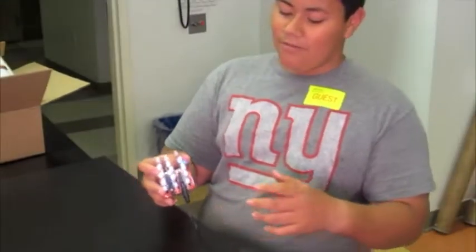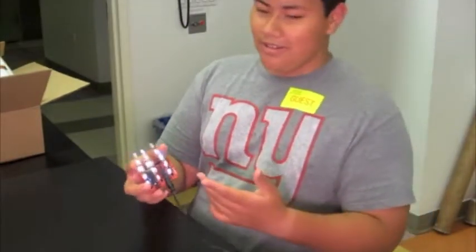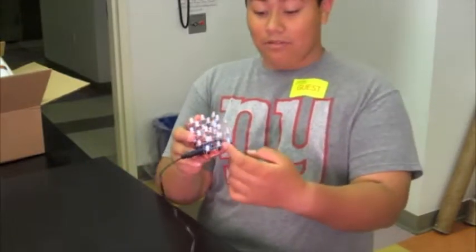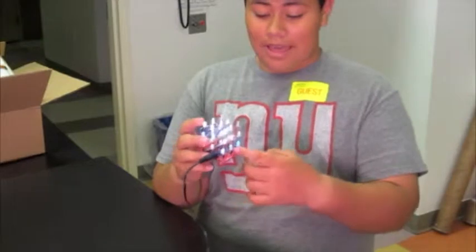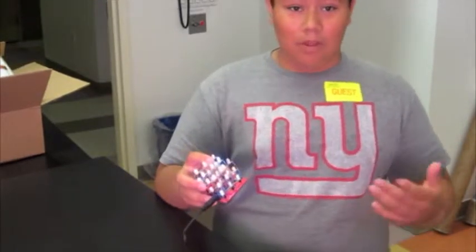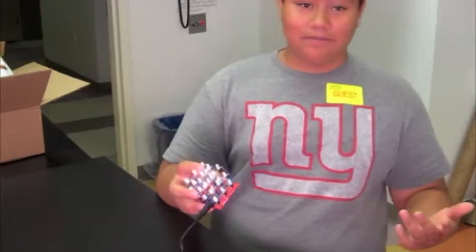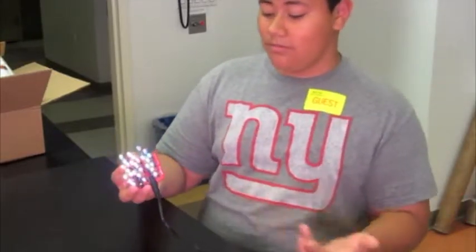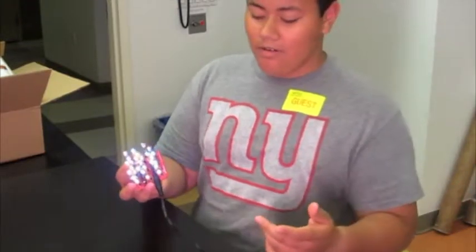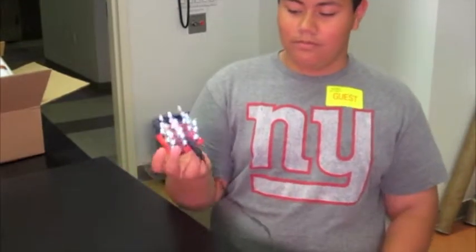And also with another wire, I had one soldered here on the second row and soldered onto the third row and into the hole labeled C, which was also blocking the connection of LEDs. So what I did is I just took the solder off, detached the wire from the rows, and look at that.